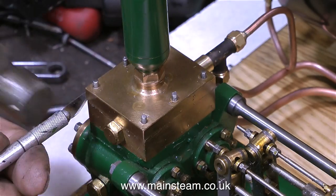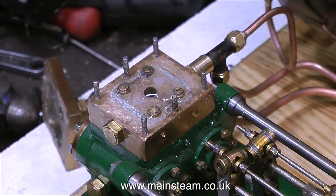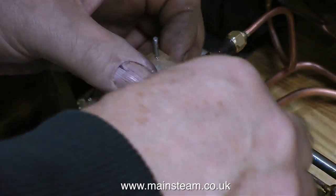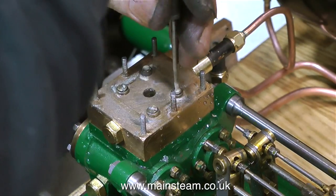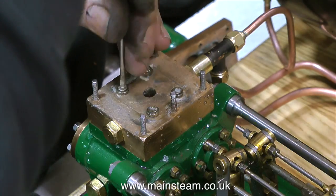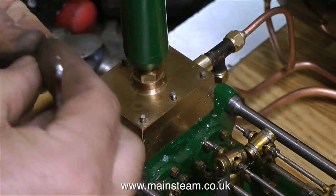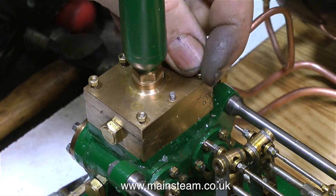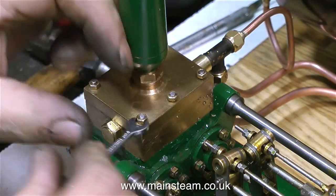Time to look in the water chest to see what the problem is. It's really stuck fast. You must never ever use silicone sealant for steam engines — this took ages to get off, it was so firmly stuck. And once I got it off, can you see what the problem is? There's stuff everywhere — it oozes outside and it oozes inside. Only one of the valves was loose; the rest were gummed up with silicone rubber. The other two needed a screwdriver to move, and the fourth one was nearly impossible — I had to use a pair of pliers. Anyway, I got them all loose, and I thought I would use some T-cut just to make sure they seat properly on the seats. With all of the valves moving freely I refitted the water chest cover. I didn't use a gasket because there's still a layer of silicone rubber on the actual metal which should do the job — at least it's not going to ooze all over the valves.